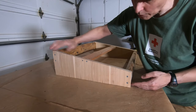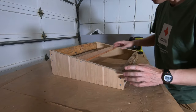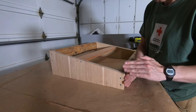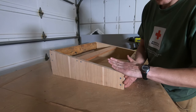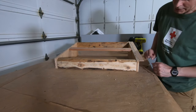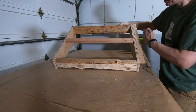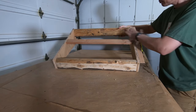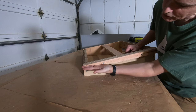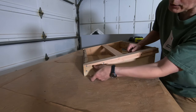The reason the ramp doesn't go all the way down to a point is because out on the quail coop, where it's gonna slip in and slide down into this little cubby hole, I've got 2x4s such that this will actually be ground level when it's in there. And because I've got a 2x4 on this side, I had to put this 2x2 here to extend the ramp so that the floor would be all the way to the very edge for the quail. The 2x4 that's on this side, we'll have to slide in at this angle. So I had to do kind of a tricky cut here just to accommodate where that 2x4 is.